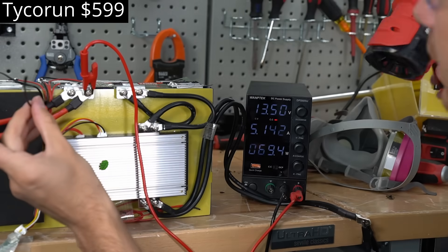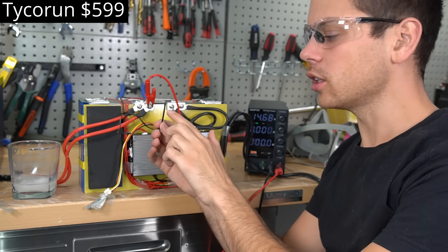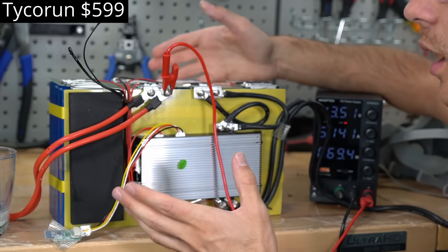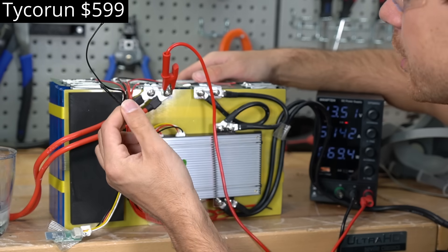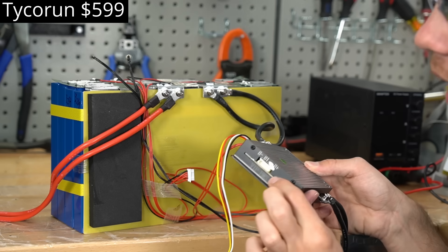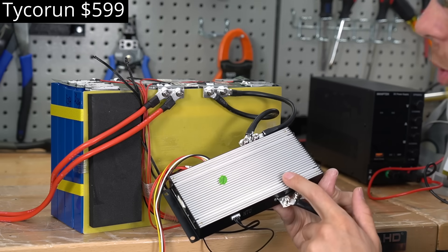Testing high temp: the battery is melting but not triggering the first sensor. The working sensor handles both low and high temp protection — the other sensor does nothing at all, and both are connected at the same spot on the BMS. Strange, but it does work. There's a heat sink on the front and back, fiberboard to protect the cells from the BMS, and it's using a VIP BMS — the same type recently seen in a new Chins battery.